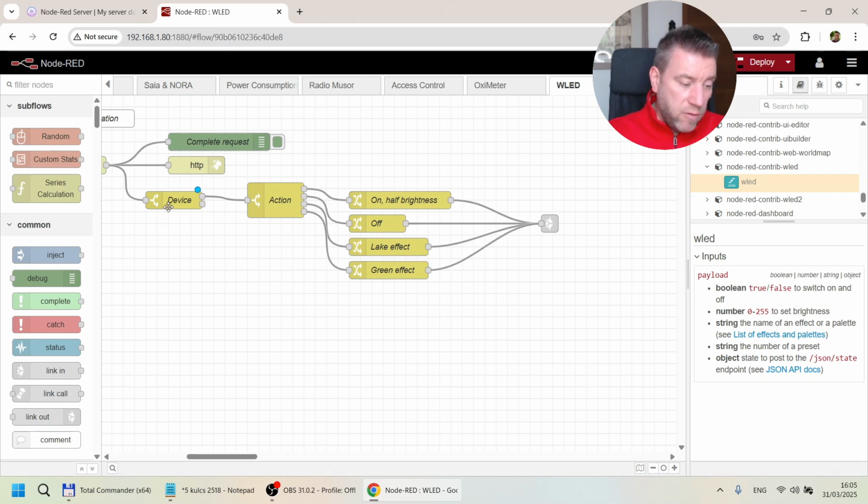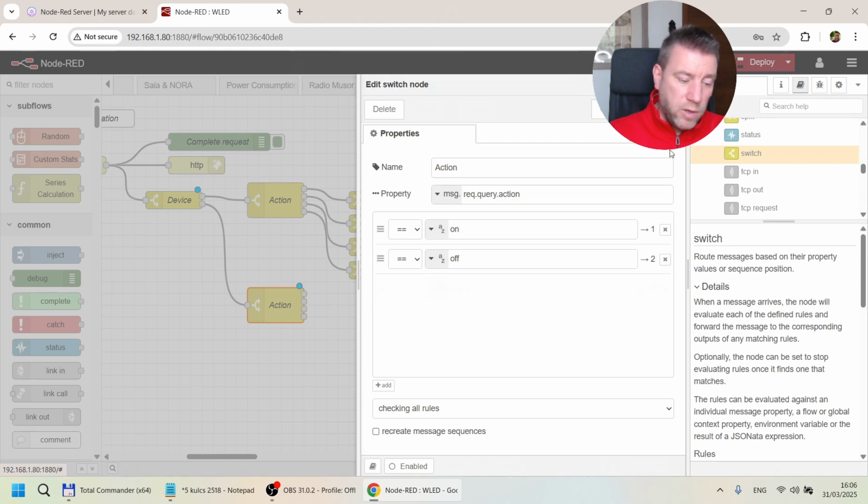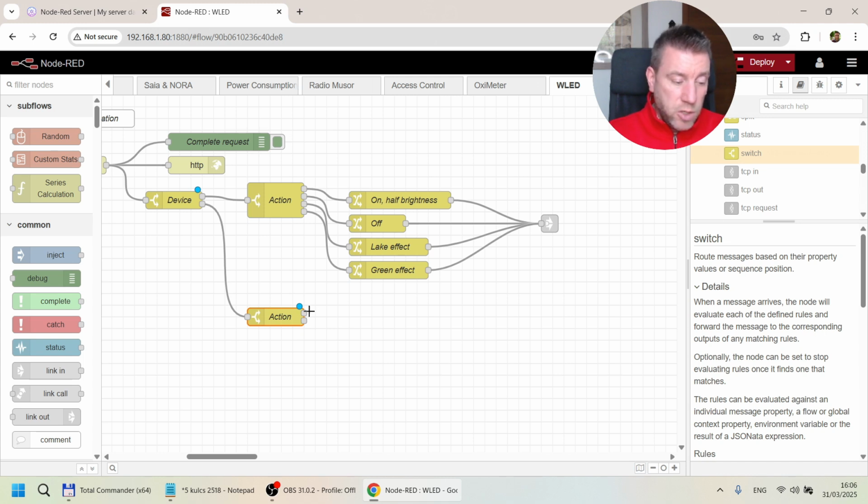And as I said, let's say you want to create multiple devices, you can also have different actions for those devices. Let's say maybe it's a simple lamp, so it only has an on-off action, and then you have to do whatever it takes to control that particular device. If, let's say, it's an ESP running ESPHome, maybe you can send some MQTT commands to turn it on and off. Most probably it's going to be MQTT, but you can also use HTTP commands here as well. There are a lot of different options available in Node-RED for how you can do that. So that is the integration that I chose to use for this particular device. But again, I think this virtual device, and how you can just send HTTP commands and process them on a third-party device, is really powerful, and it opens up this device to be able to control so many other things, not just regular infrared remote controllable devices.